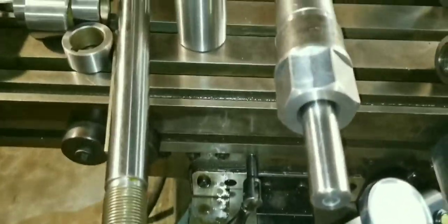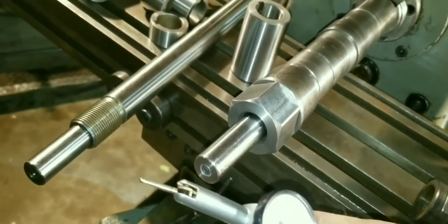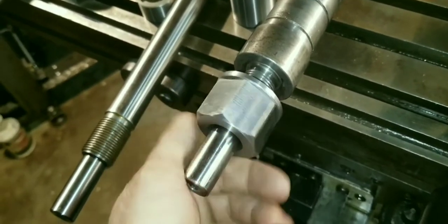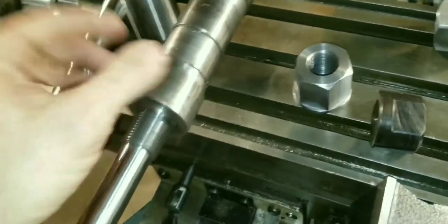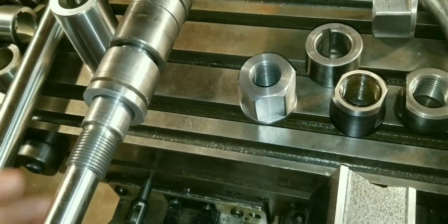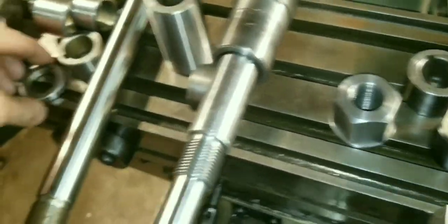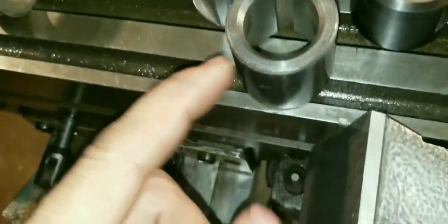Let's crack it loose and show you the bad ones. I do highly recommend putting hex nuts on these things if at all possible — I went with one-and-a-half inch hex. So I was pulling the spacers off. Even the factory ones — that's a new one there because I didn't put the blade on so I had to add one — even the factory ones, the hardened ones, or at least harder than the homemade ones, they're boogered up too.